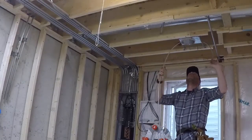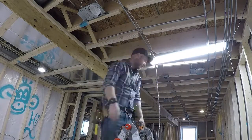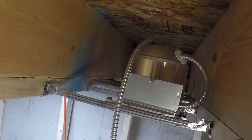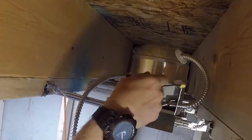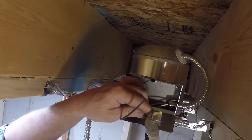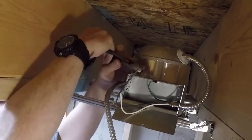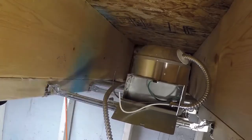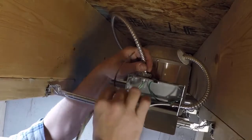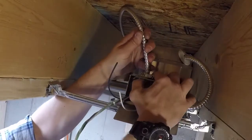Running the clad wire from the cans was super easy, especially since I left notches in the joists when I furred down the ceiling to match up with the existing electrical installed by the builder. Connecting the wire to the can is just like connecting conduit to the boxes: cut the connectors off the wires in the box since you don't need them, push out the knockout with a screwdriver, put your wire through, and tighten it — make it real tight.